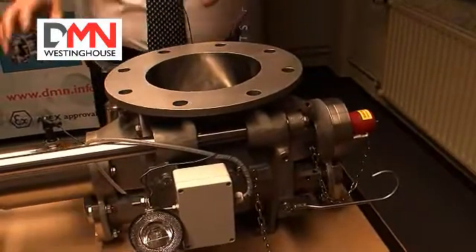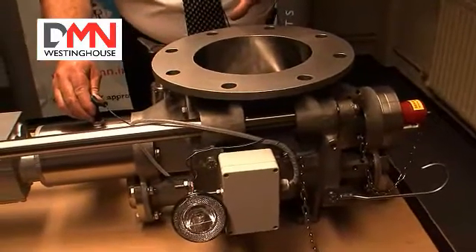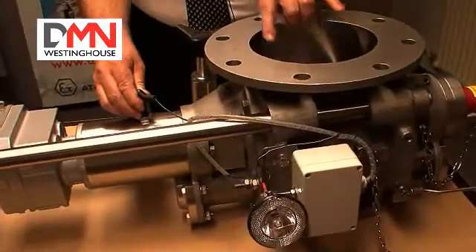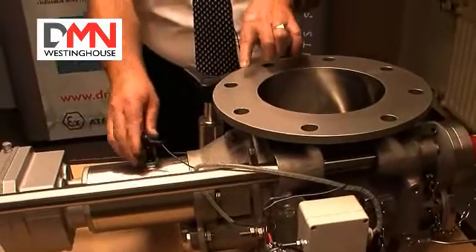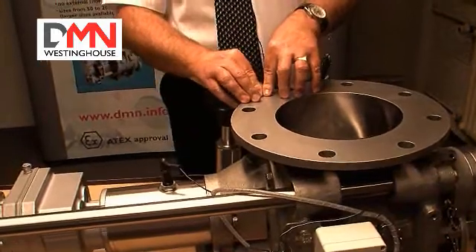When we use this sensor, which is connected to the rotor, and we get a metal to metal contact between the rotor and the body or the end cover, we will get a signal and we will know that something has happened in the process that shouldn't have happened — that we have a potential contamination of the batch we are processing. It enables you to reduce the amount of product that has a possible contamination and to identify where the problem is.